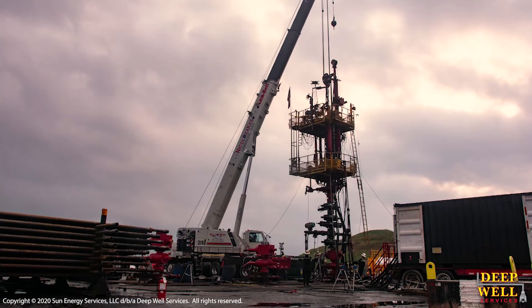One of the efficiencies we've created is not only on the drill out but on the rig over process as well. We've engineered into our rig floors and substructures the ability to have a one-pick design. Essentially, what that means is we are able to rig up on the first well conventionally — set up our primary BOPs, lift the unit on, and start the completion program from that point.